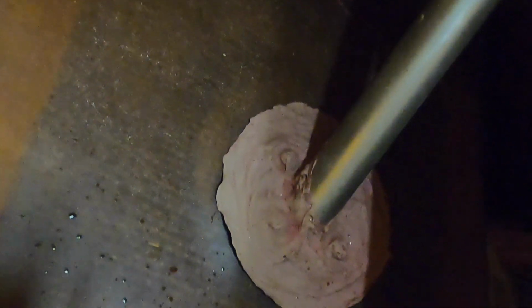and then get working on removing. You can see that it's peeling up, so I just need to tear it out, use an emery pad or something, scratch up the fiberglass a little bit, put the correct stuff in. And a couple small leaks to get fixed up. I don't like having an aircraft that's leaking. There's my bearing block down there in the bottom. I'll have to go get that.